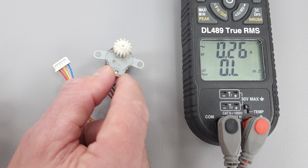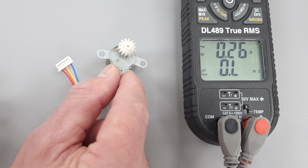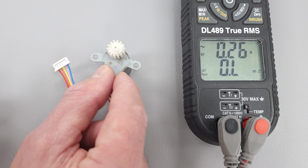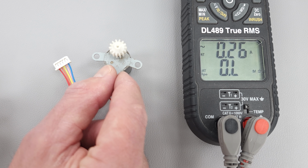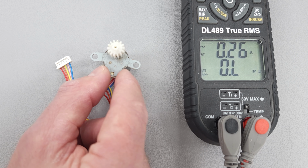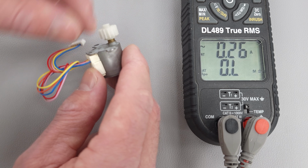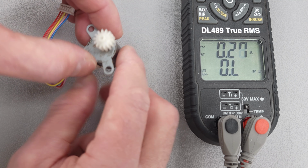The other thing is you always want to turn the power off to the mini split if you suspect a louver motor problem, and just see if you can slowly adjust the louvers yourself manually, just slowly. You want to see if they're stuck or if there's some type of issue. But they will feel a little tight, and that's the whole point, because you have the gearing inside. You don't want to be turning this real quickly or trying to apply too much force, because you have those tiny little plastic gears on the inside.